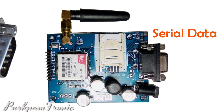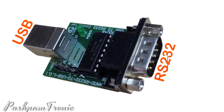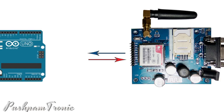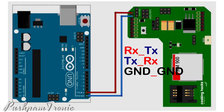The serial data can be communicated from the DB9 female connector. We can also use these types of connectors which follow the RS232 standard to connect the module directly with the computer. But certain controllers or processors might not follow this standard, so we can use Arduino to communicate. The Arduino and the SIM900A both follow 5V TTL level. Here is the TTL interface of the board.